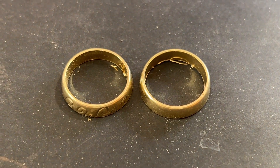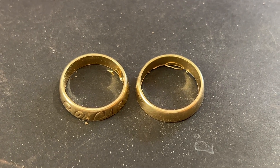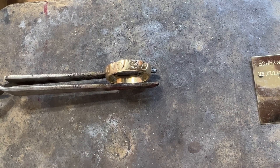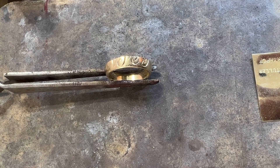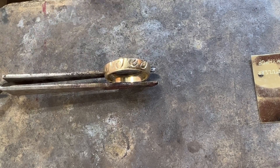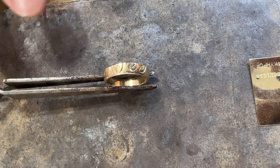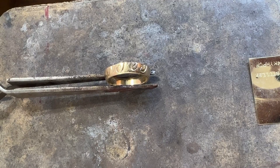We have our bands cut in half. Now we're going to clean up and stretch one of the rings up to a size eight. These rings have some engraving on them, so the plan is to fill in the lettering a little bit with some more gold. Then we're going to anneal it and strike it with a hammer to size it up, trying to focus most of our efforts on the thicker side to help change the shape of the ring and give it more of a taper, so it's a little more balanced.